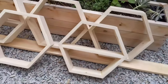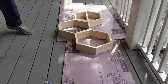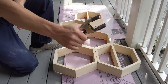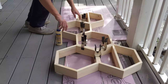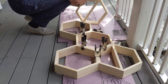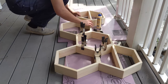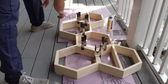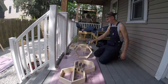With five freshly sanded hexagons, I took them to a flat surface where I shuffled them around until I found those that fit best together in the pattern I wanted to create. I temporarily held them in place with squeeze clamps. I started gluing the edges together, being generous with the amount of glue, and spread the layer evenly across both surfaces. I used two to three squeeze clamps to hold the joining edges together while the glue dried, and repeated this step with each adjoining surface.